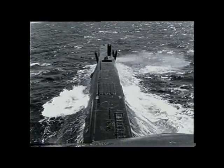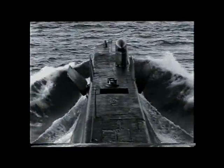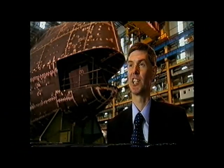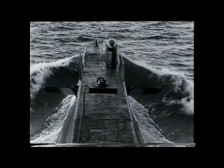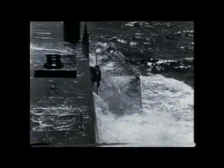Within five years, the French had again provided the answer: give a submarine wings. A lot of people don't realize that a submarine essentially flies on its hydroplanes like an aeroplane. The only way it can move in the water — up or down, or through the water — is by being propelled, and by the diving surfaces, the hydroplanes, forward and aft, which tilt to drive you down or tilt up to drive you up. The French Navy added small horizontal wings to the front of an experimental submarine.